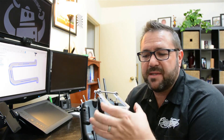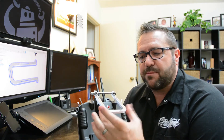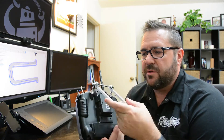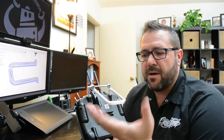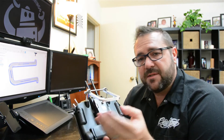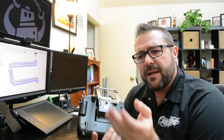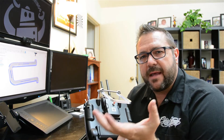With CNC, we're starting with a piece of stock material, and we have to tell it every operation that needs to be performed to create this part. There may be things like pockets carved into the metal, boring to bore out the holes, and a 2D contour to cut out our part. When configuring each of those operations, it really comes down to feeds and speeds. Feeds and speeds are dependent on the tool being used, the machine, and your preference. A lot of times, if you slow it down and don't bite as much of the material, you can get a cleaner finish.